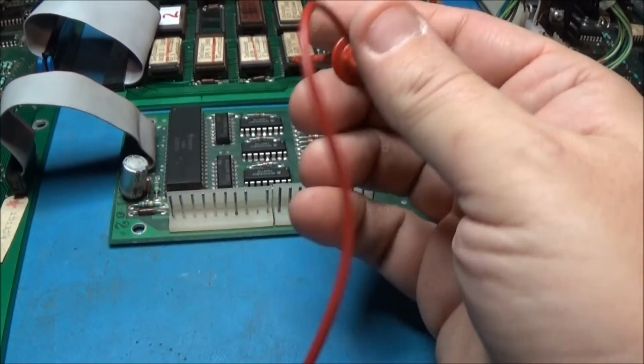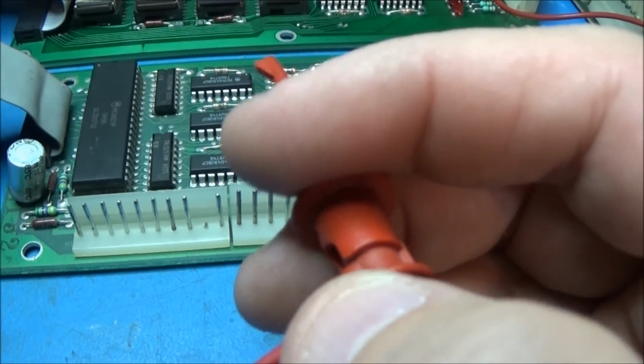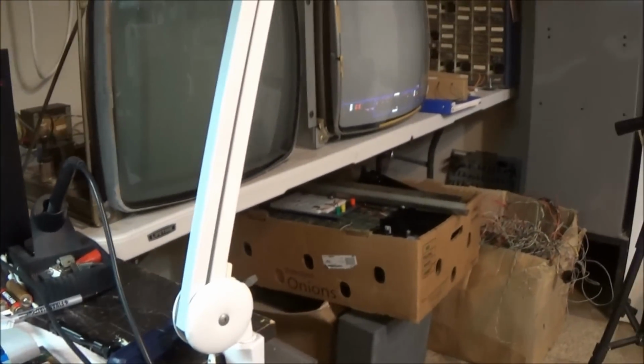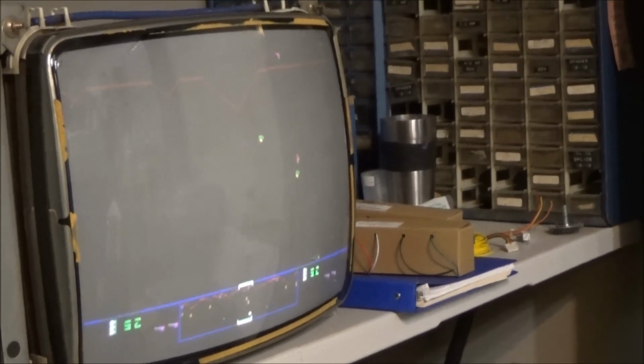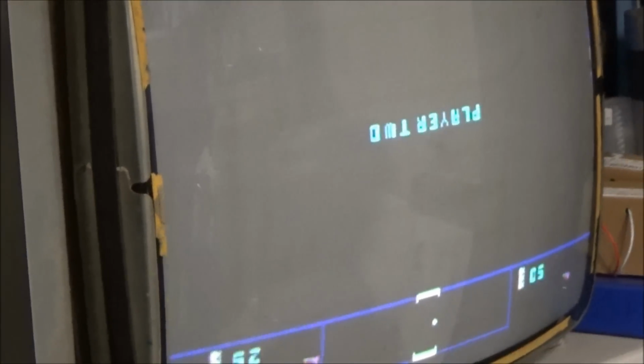Yeah, guys, I replaced these three guys right here just to try to shotgun this thing, and it didn't work. Turns out the PIA is bad. Now I got reverse, but it's goofing up. See, I got it jumped. It's upside down. The picture's upside down. See, now I went up, but I can push reverse now. See that? I'm reversing now.